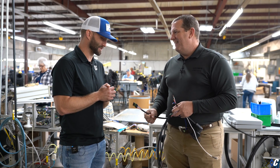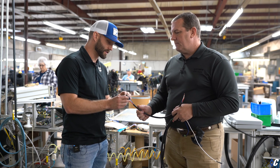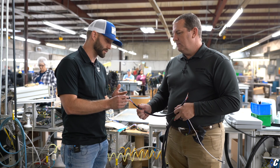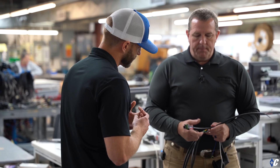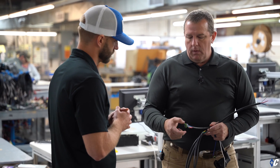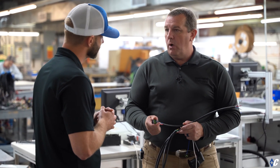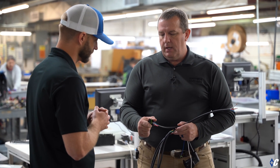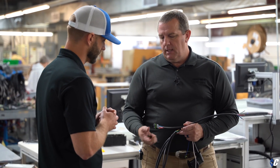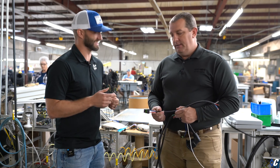Much longer durability with that as well. One other thing I want to talk about is this part right here — this is something that traditionally would fail with corrosion for some of our brakes over time. Traditionally, what's been used for brake splices is a butt splice. But Diamond C Engineering wanted a waterproof connector, so we worked together and found the proper connector size — totally waterproof and plug-and-play. That's especially important with snow for some of our northern customers.